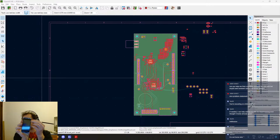So you can imagine this. Either you have to use it like this, which is not the way the screen is going to be oriented in the final application, I guess it would make no sense. Or we would have to place it on the top. But on the top, we have the connector for the USB power supply, which I expect is going to be used a lot because it will be more convenient to use 5V from a power bank than having to use two lithium batteries. So if we decide to put the SMA connector on top, that means that we are going to have basically the USB cable and the antenna at the same place.